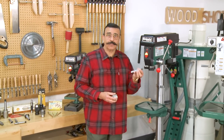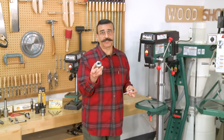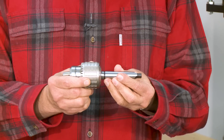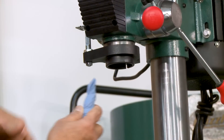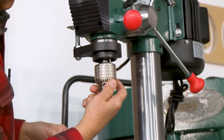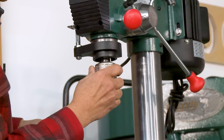The taper inside the spindle, the tapers on the arbor, and the female taper on the drill chuck are all friction fit tapers. That means they need to be absolutely clean and oil- and grease-free before inserting the arbor. Wipe off the protective oil or grease with some rags and then with some alcohol or degreaser to remove any remnants of oil. Do this to the spindle, both sides of the arbor, and the taper hole of the drill chuck as well.